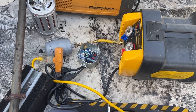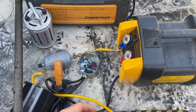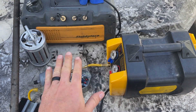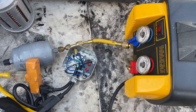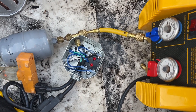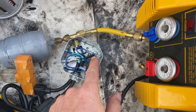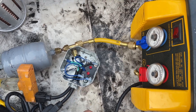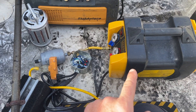I've gone over this once before in detail but I'll do it again. This is the perfect application for this thing right here — instead of having to babysit this pump to make sure I'm not pulling the system down so far that I'm getting air in my recovery because of a leak, this is just going to auto cut it off. It's a pressure switch that opens at five and closes at twenty, with a relay with a 120-volt coil. This little switch controls the relay which in turn powers the pump — a great little thing you can build yourself to auto control your recovery.